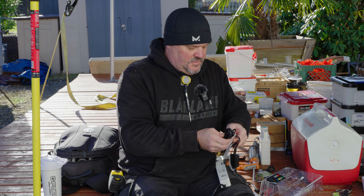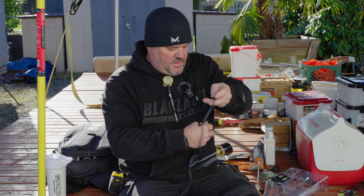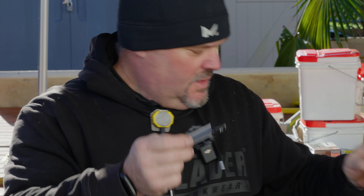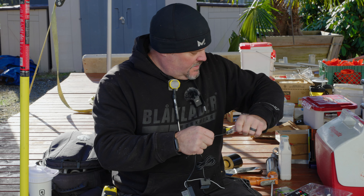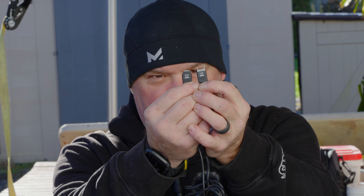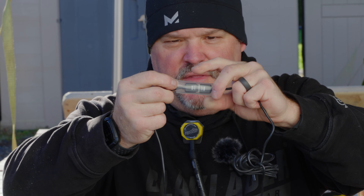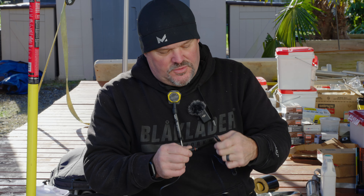Here's the receiver for this system - it's directional, it has to go in a certain way, and there are different shaped plugs that only fit one direction. There's the receiver wire and light connector, and there's also a piece of heat shrink to make sure these connections stay together. You take the adapter - there's a male and a female that go together, they clip together, and then you put the heat shrink over that and heat it up with a heat gun once centered. That keeps it from wanting to pull apart. These lights are linkable - you can do quite a few, up to 60 lights off one transformer.